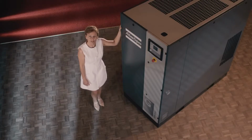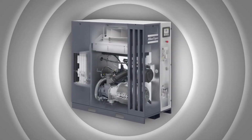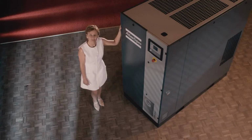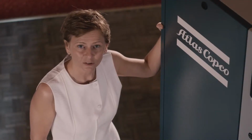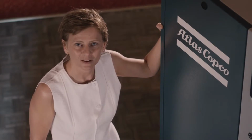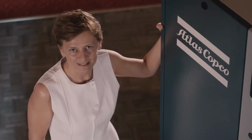We rearranged the dryer layout to minimize the footprint. Another result of the new layout of the unit is a lower noise level. The inlet baffle is now located on the side of the unit. This reduces direct noise emission from the drivetrain. All noisy parts are hidden, making this a true workplace system.